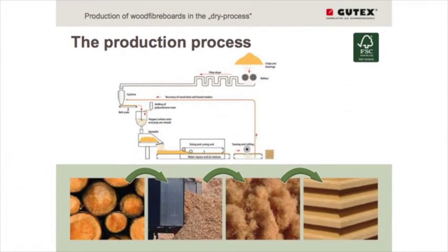A few years later in 2004 we started to produce with the dry process line. The beginning of the production is nearly the same as the wet process — we also use chips as raw materials, but only chips without bark, because we need longer fibers. The fibers are cooked and milled in the refiner, then dried before we make boards with them. That's the big difference: all the moisture in the fibers is dried out before we produce boards.